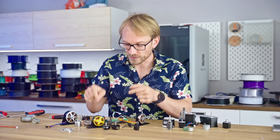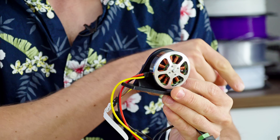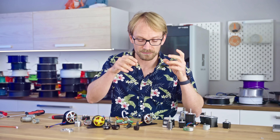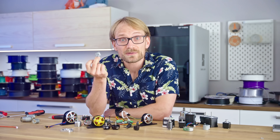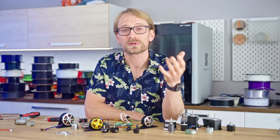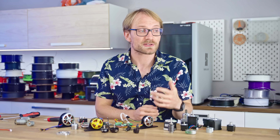But would it be cheaper to use servos instead of steppers? That's something I don't have a definitive answer to. Right now, this BLDC setup — which I'd put at least comparable with a NEMA 17 drive — cost me around 40 bucks in parts, while a NEMA 17 and a driver are closer to 15 bucks. Of course, those prices can come down at volume and the motor and electronics can most likely be engineered to be cheaper, but the magnetic encoder would need to be replaced with something more cost-effective. Not impossible, but I think more work than most 3D printer companies would be willing to take on. In the case of stepper motors and 3D printers, we might just have reached 'good enough.' With a bit of smart software, stepper motors have achieved incredible performance to a point where the other parts in a 3D printer are now the bottleneck, and switching to BLDC servos just because they might be better might not even improve the product that is the entire 3D printer.